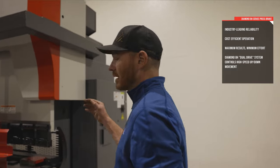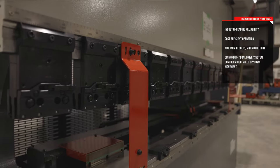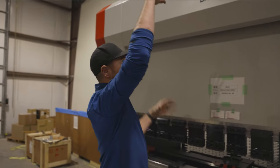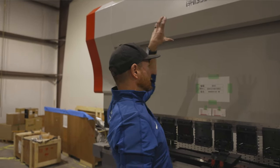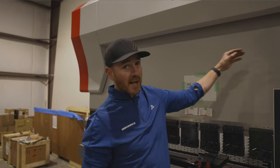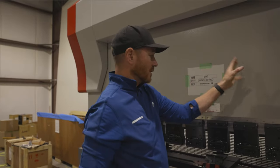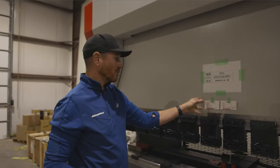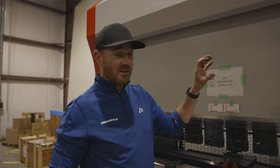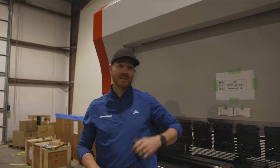All right. So here's our press brake. We have fully independent back gauges and one-touch clamps. One cool thing that you can't see yet — up here we'll have a video and projector system that shines everything onto this plate right here. It will measure your hand movements, you'll be able to change settings, spin the model around. It'll show you which dies and punches need to go in which location, and it shows the profile of the punch. Super cool. Should make setup and teardown really fast for each individual stage.